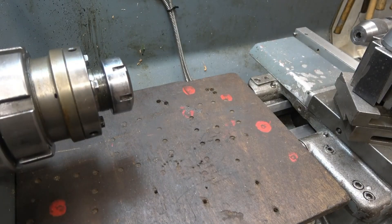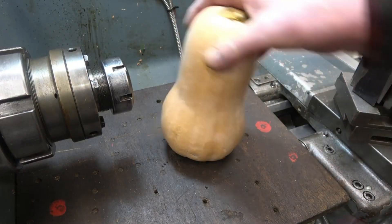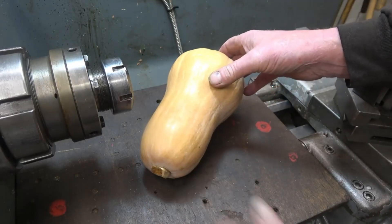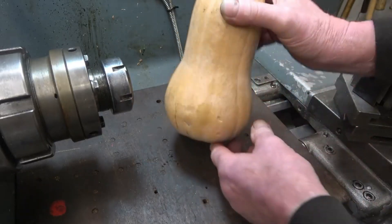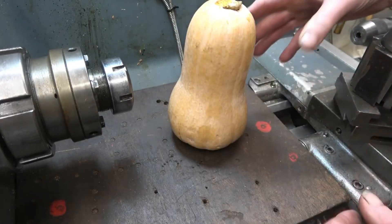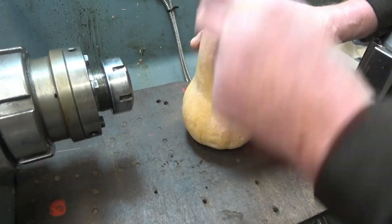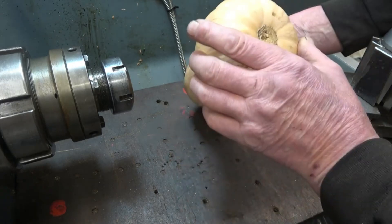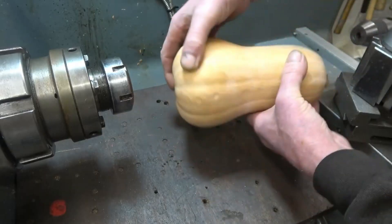I've got a strange sort of material to machine — I want to take a hard face off it — and that material is a butternut squash. I haven't machined this stuff before. There's very limited information on the internet about machining it. I've done carrots and turnips, and I did a pineapple once, but I've never done butternut squash. I'm going to machine it on a mandrel, so the first thing to do is drill down to the centre — quarter inch — because I've got a six-mil stainless steel mandrel. I'm going to drill it on the lathe, freehand from each side.